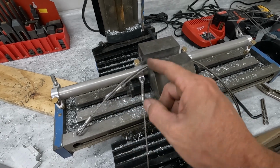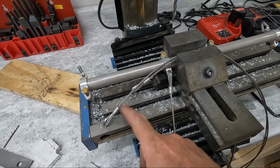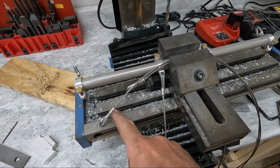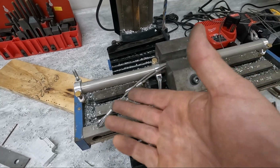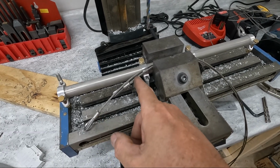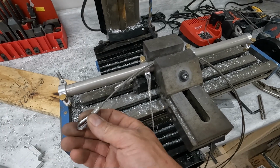And what I ended up doing is, once I had them connected here, I cut the cables to the exact same length, ran them out, and then I used the tail that was still remaining sticking out to measure where this needed to be crimped. If I had 4 inches from the crimp out of extra cable, then I knew I had the exact same amount on both sides, and that's what it ended up being. I think I cut them at 60 inches long, and I ended up with 4 inches of length from here to the end of the cable that I cut off afterwards. That's how I was able to get them as close as I could, instead of trying to physically measure them to the end and crimp.